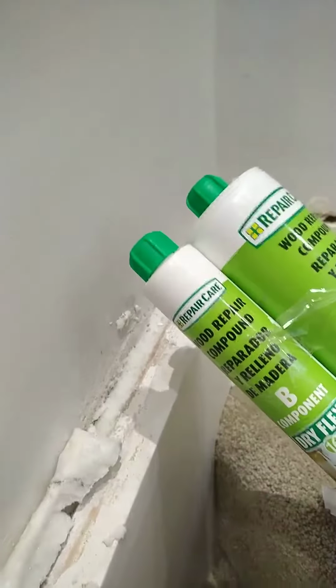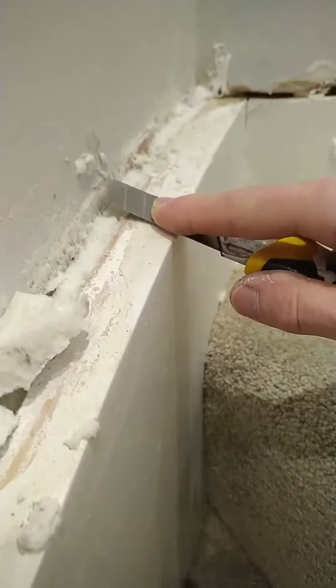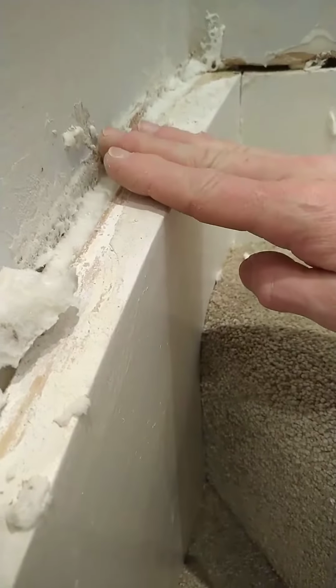Even though resin is the best solution to that problem, it still could happen. So I'd rather, instead of just doing it flat like that, bevel it slightly. So see that little gap under the knife? That's where the filler will also be. So you're spanning right the way across. And just by being at that slight beveled angle, it doesn't look funny.